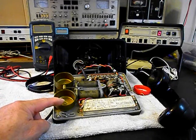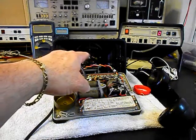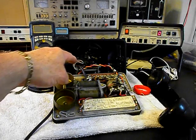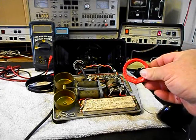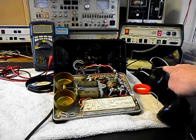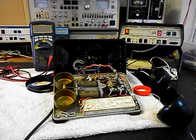We went through the bell and bell circuit — the bells have been adjusted. We also cleaned, oiled, and adjusted the rotary. The hook switch was taken care of and cleaned. So there were a lot of different issues that were resolved. Now we are working on the handset. This is our amplified pickup, which we use in repairing, troubleshooting, and on our final checkout. It's amplified so you can hear the audio from a receiver. You may hear a little noise from the amplifier — that atmospheric hum is not an issue.